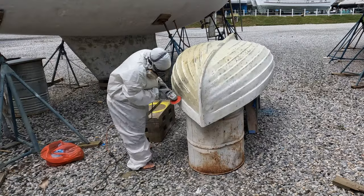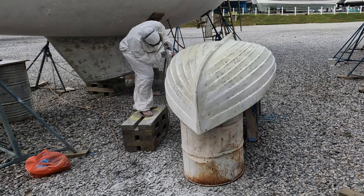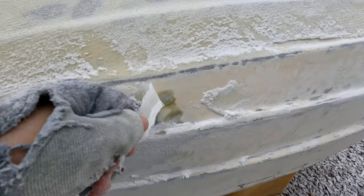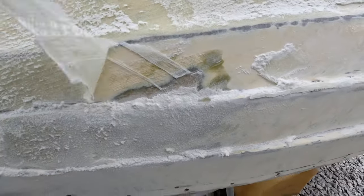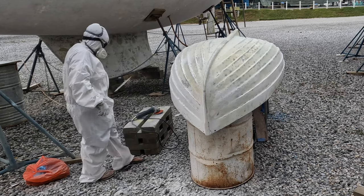Dinghy project. I had to grind off all of the fiberglass that did not adhere to the dinghy, which was basically 90% of the fiberglassing we did — it was not touching the dinghy. It was up in the air; it was air bubbles, detached from the dinghy completely. We have delamination on the deck, and here we are filling in the voids with expensive epoxy, which is a great solution. Now the deck isn't creaking anymore, but we created another problem with the dinghy — voids and delamination of the fiberglass from the dinghy. So I wasn't going to keep it like that. I ground it all off.